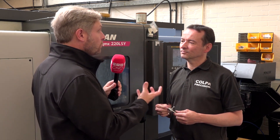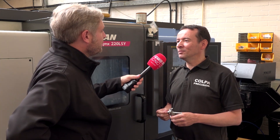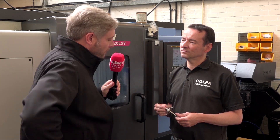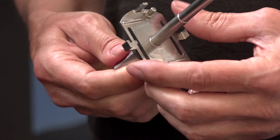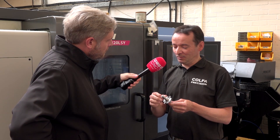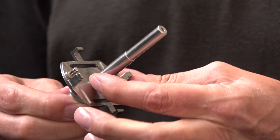So you added value in terms of the drawings, scanning, and design of the parts? Yeah, it was done so that we could actually machine it. This part is one component — one piece of metal. The original had two pieces of metal that were brazed together, but we were able to make it one complete part.